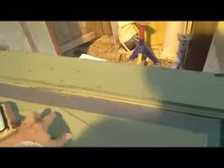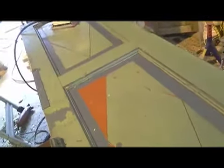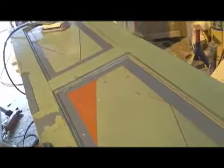Which is important to do because obviously even painting with linseed oil paint is still not going to key very well to the old paint. The old paint has a very oil-rich consistency. It's what we call fat, at least in Norwegian it's feit, which means fatty, which is not good for a new coat because the more oily the undercoat is, the more difficult it is for the new paint to sit on top.